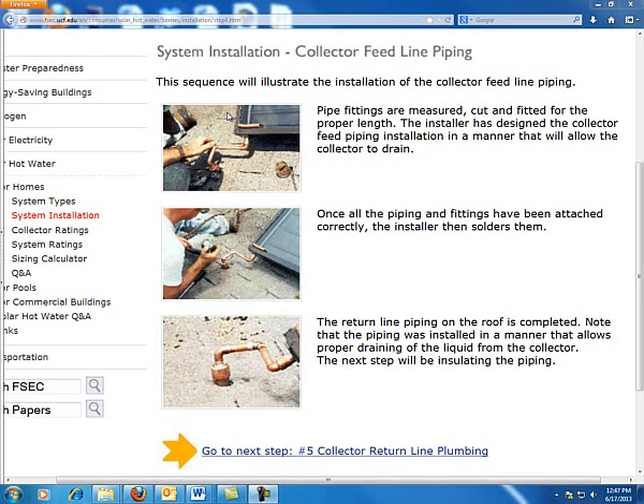Generally we're going to be okay if we buy a complete system or package, but there are some issues to cover. Every fitting insert we have will introduce a loss — a restriction that the pump must overcome in order to deliver the required flow.